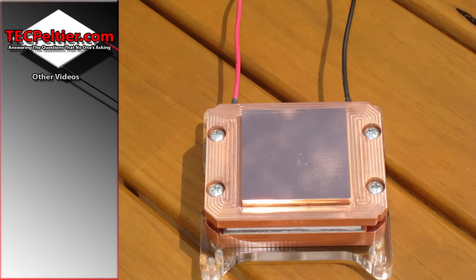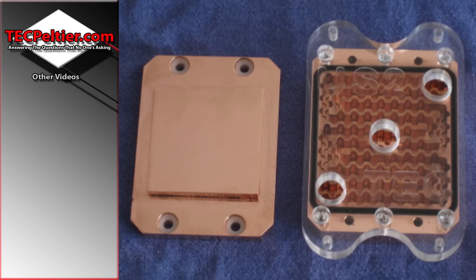Another very effective design feature of this block is the hot and cold plate bolt insulators. One of the problems people face is that the bolts applying the hot and cold plates together are made out of steel, and they will conduct heat between the hot and cold plates, which reduces efficiency. So I've put a plastic washer with a sheath on the cold plate, so when the bolts are applied they are not touching the cold plate at all — they push against the plastic washer, and the washer pushes the copper to the bottom of the TEC, insulating it.